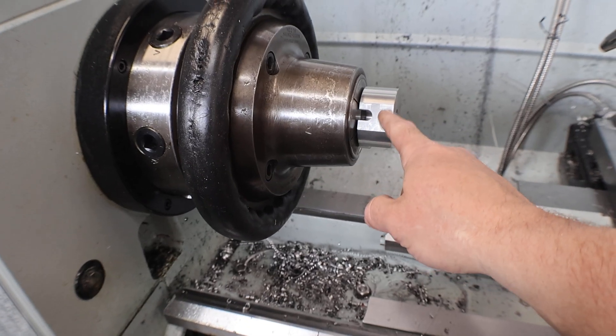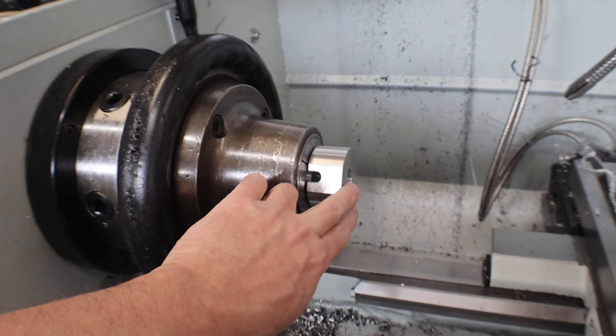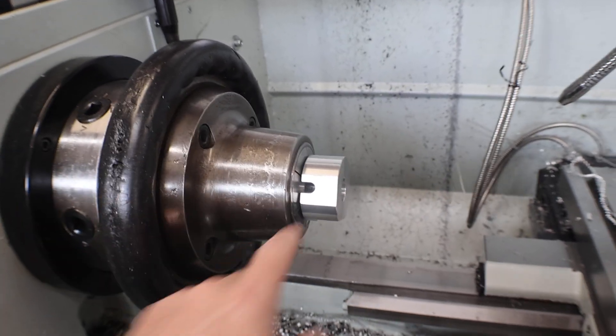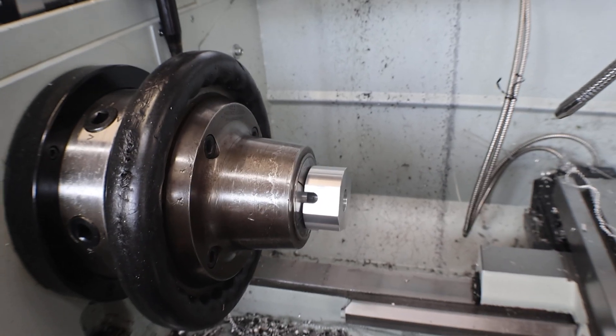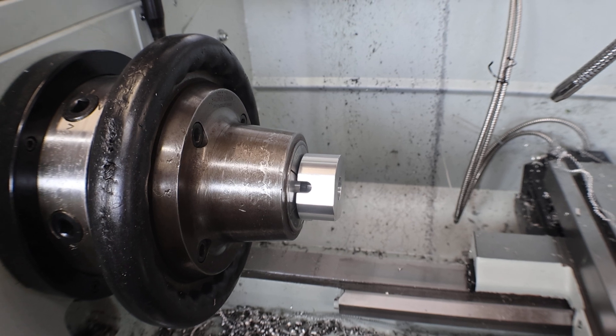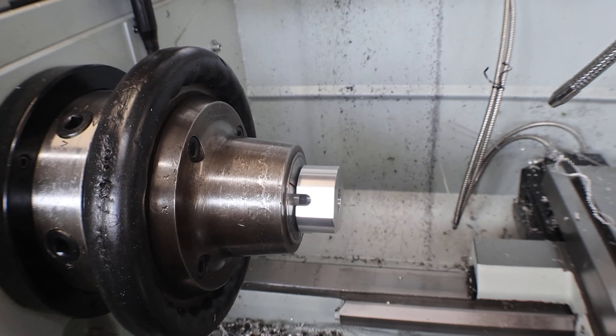The way they're trying to do it at work is not with any extra material, and in aluminum it probably won't spring — but they were talking about doing them in steel and it might spring open once you cut that slot in there. So I'm going to leave it, mill this stuff or turn it down, and then it'll be almost done.